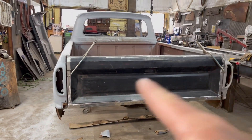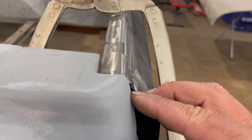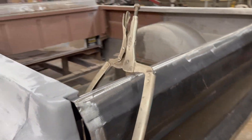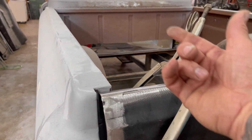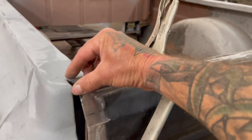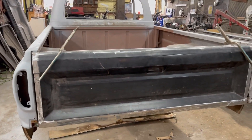It's going to look badass. So I think the next thing I'm going to do is whack that tailgate top piece off, flip it around. The other thing — from a side view — the top of this tailgate is not rounded, it's rounded a little bit right here, but that matches exactly right here. This is supposed to be flat but it kind of drops at an angle. So I'm going to manipulate this thing, massage it a little bit, beat some metal around with hammers and dollies and get this piece cut off and flip it around. The other thing I was thinking is what if we ran a one-inch strap all the way across this — that way it's got that one-inch line to drop down that you can weld to.